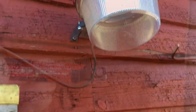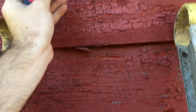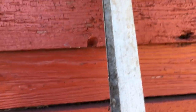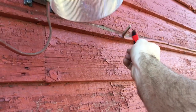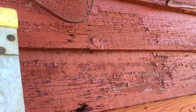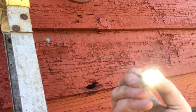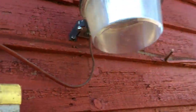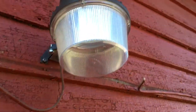Just one more note — these voltage detectors are really nice. You can hear it beeping, telling you there's power there. It takes a lot of the guesswork out. And just to show you, this wire here is dead — nothing there. It's a Milwaukee, about $20. It has a light on it for dark places, which I thought was a weird idea, but it does come in handy. Last clip I'll show you what it looks like at night.